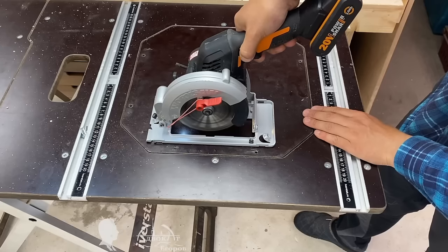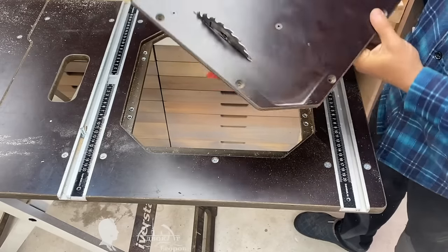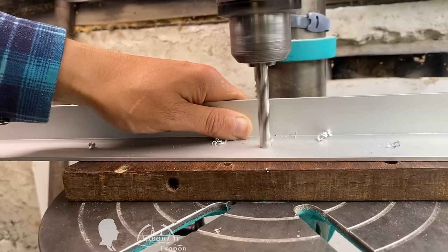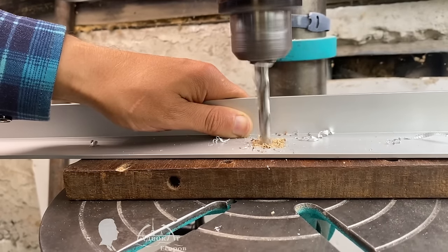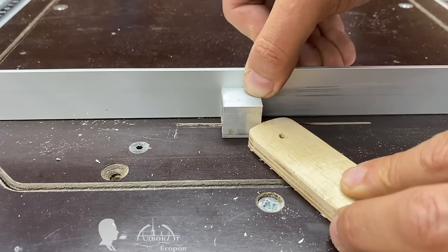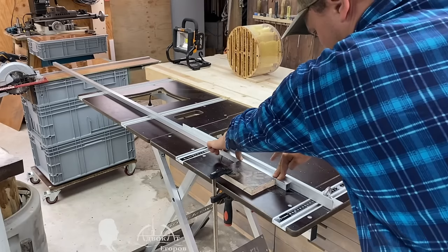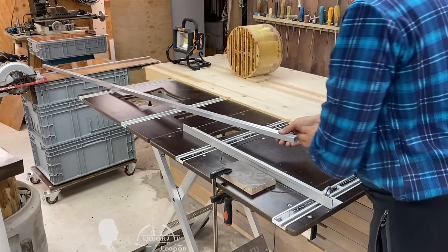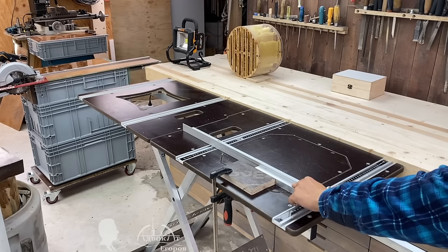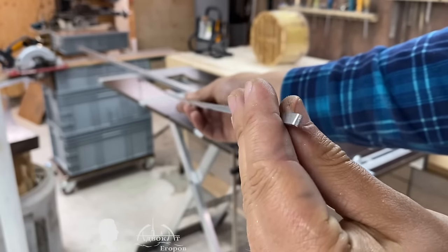The workbench panel is now full of holes, which is not a problem. To complete the setup, I need a table saw fence — an aluminum angle will do. Marking two holes and drilling is not difficult. It's better to drill with interruptions so that the chips are shorter, making them easier to clean up. Now with the circular saw in the inverted top, you can set the minimum cutting depth sufficient for cutting through the wall of a square profile and make a test cut. If the result is satisfactory — meaning a slot clamp fits into it — you can proceed to cut the 2-meter profile. For added reliability and safety, you can use a clamped block as a feather board. After making the first cut, the profile needs to be flipped over and a second cut made. It's better to use a narrow kerf disk for such purposes, as there will be fewer aluminum chips.